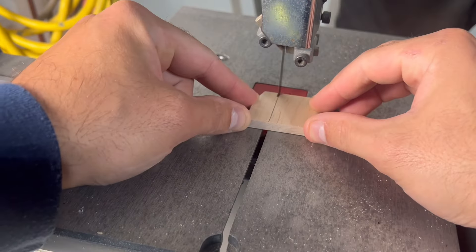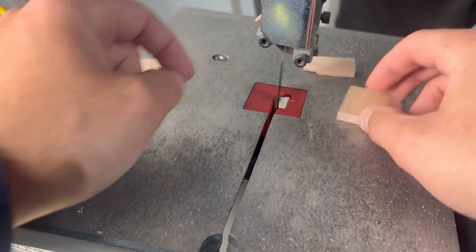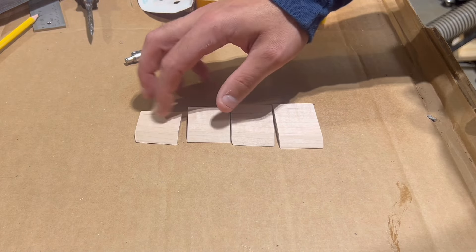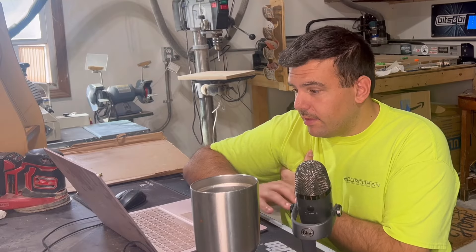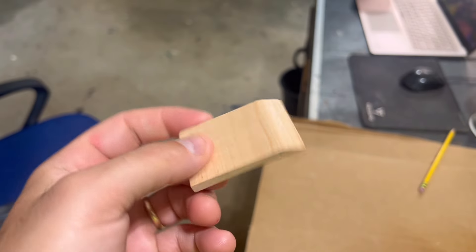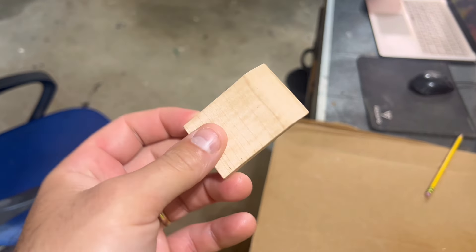Once that angle is set, I can cut the piece into four one-and-a-half-inch wide strips that should be able to fit through the holes on the sorting ramp. After I know that those fit, I break down the guide ramps further into staggered length strips based on the measurements laid out within the build manual. Finally, in order to finish them, I measure half an inch in from the ramped side and drill holes on either side that will later be able to accept screws.